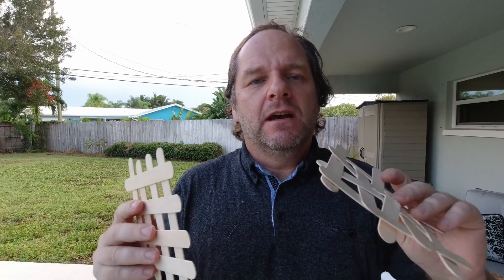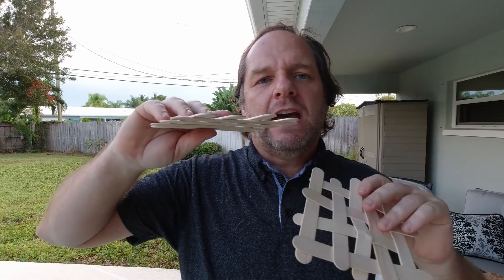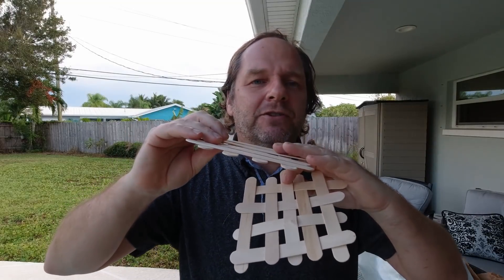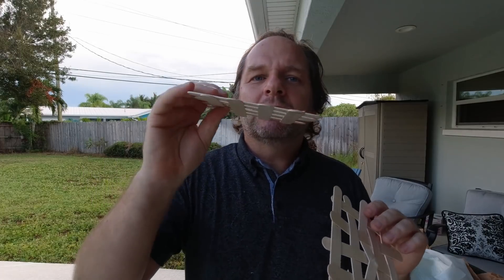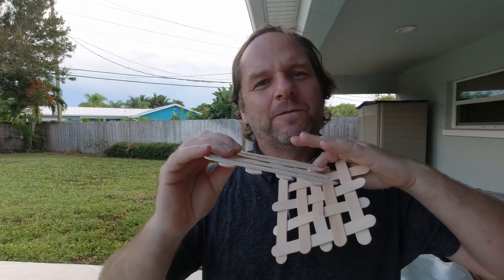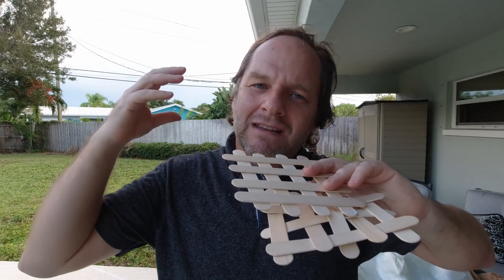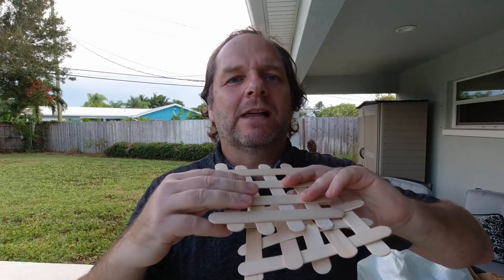So which one is better? Well, both knit and woven serve different purposes. The key to making a strong laminate is to have the least amount of resin you can have and the maximum of glass — that's your glass-to-resin ratio. You want it very high glass. A good ratio is 50% for hand layup; you can get down below that in the 40s with vacuum bagging. But it will depend on the cloth you're using too. However, that only goes to a certain point — if you get not enough resin that it doesn't fully wet out the fabric, it'll go backwards and become weaker. You want the fabric completely wet out but with the least amount of resin possible.